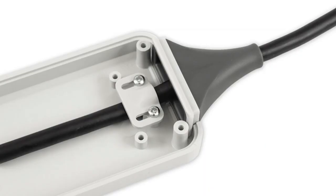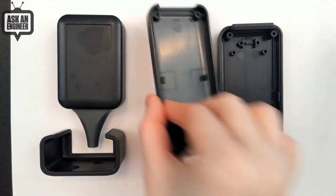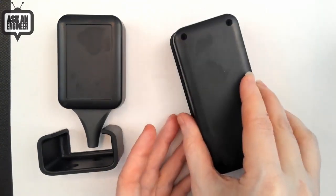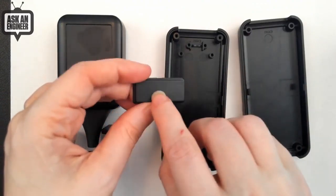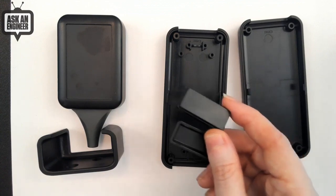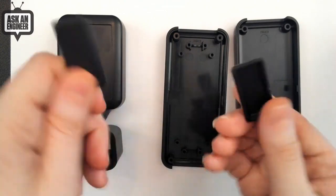It has some cool accessories. It used to be when you got an enclosure, you just got two pieces and you're on your own. But now they actually come with some extra stuff, which I think is nice. So let's go to the overhead and I'll show that off because I ordered these from Digi-Key — got them yesterday. This is the enclosure style; it comes with some screws that I've removed. This piece clips in and actually even has some snaps, and then these are the two removable pieces. They're thin ABS plastic, really easy to drill and machine. And if you're doing more than a couple, you can actually contact Hammond — I think at around 50 or 100 pieces or more, they'll even do it for you. You give them the CNC file and they will cut and drill the front plate, back plate, or the side plates.